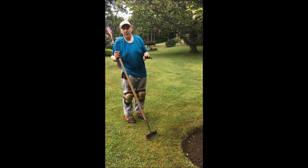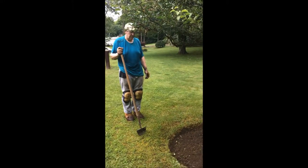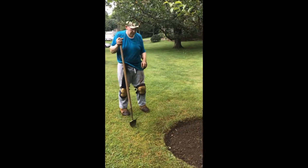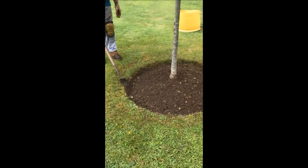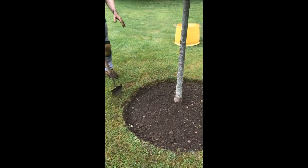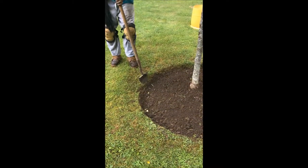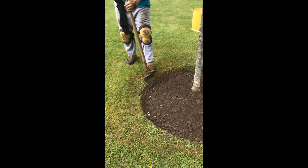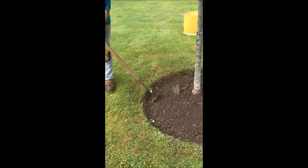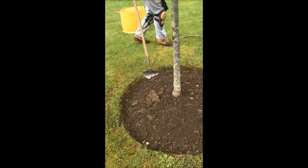Now we want it perfectly round. Look at that — I'm almost certain everybody would say that's fine, good enough, and it would be. But I have a chance here to show you how to make them round and what you look for. They're called flat spots. When you're trying to make a radius, you look for flat spots — right here's one. You can see if the radius continued, right here's what you'd call a flat spot — it cuts into our radius. Once you learn to recognize those, in very short order you can easily cut that flat spot out. I'll bet that's going to look rounder now. Then you just continue on around and keep your eyes peeled for another flat spot.